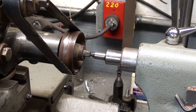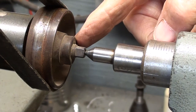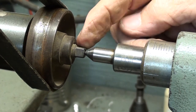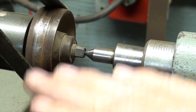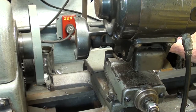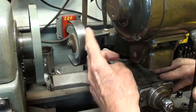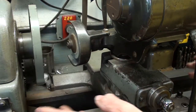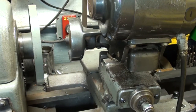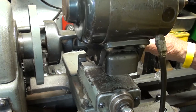This is not a complete video on how to use a grinder — I'm just showing you how to set it up. Notice that the tailstock center is in alignment with the center of the shaft of the grinder. So I have the right elevation, and the grinding wheel is on center with the work. This adjustment can be made with the compound, or you could lock the compound and swing the tool post on the compound. What I want to do here is to square up the wheel with this faceplate, so there's no center in here, and I'm just bringing the wheel up against this, and that gets me pretty darn square.